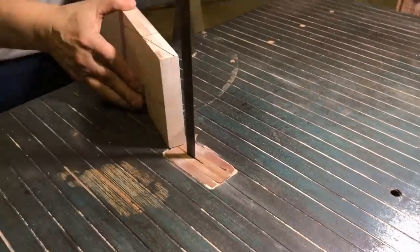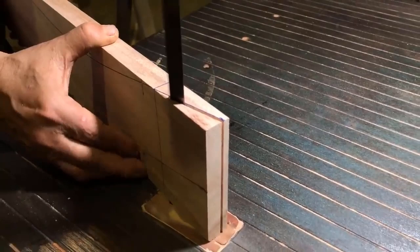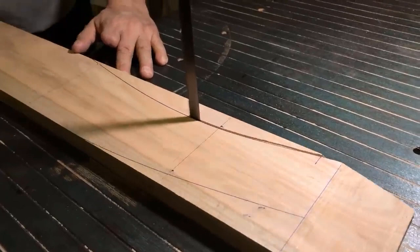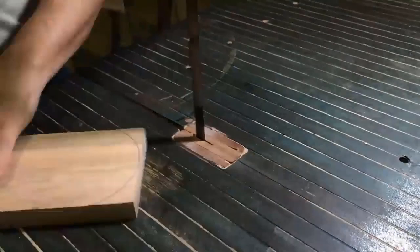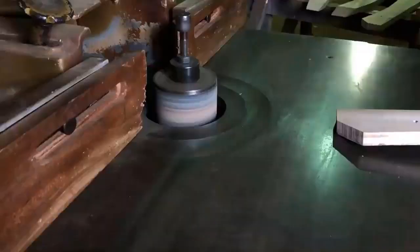That cut at the back of the armrest — you can cut it with a saw, or once you cut the armrest, mark it on the other side the same way. You can slowly remove it with a chisel and then remove it with a rasp. We cut the tip of the armrest, always leaving the line — that which would be the backrest support is the support below.